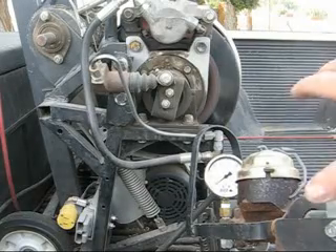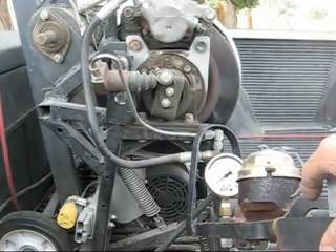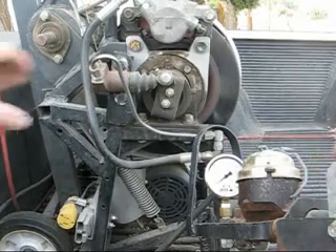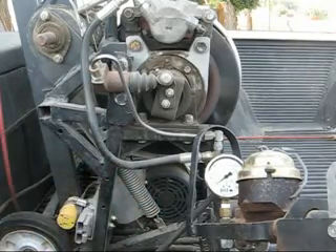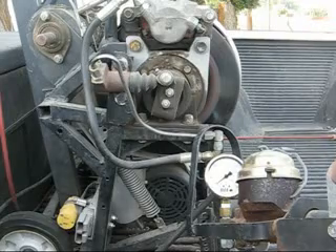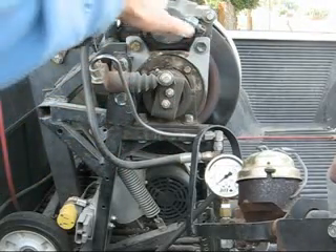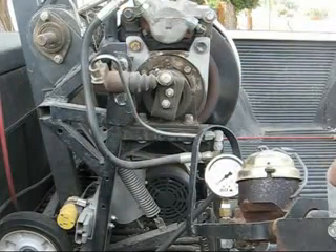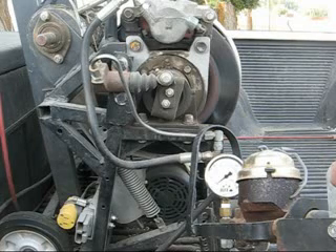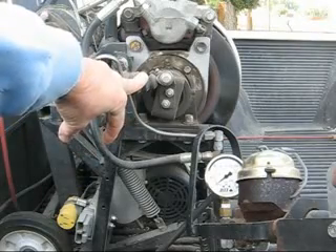In addition to the conventional hydraulic cylinder, master cylinder, and brake caliper used in the braking system on my auto-tension winch, there is a slave cylinder teed into the hydraulic assembly, and a spring used to control actual line tension. There's also a pivot mechanism connected via an actuator arm through to the hydraulics, which allows the brake caliper to free-float without resistance on the axis of the drum. You set your tow line tension with the spring, and the caliper will tension up and pull to the point where the hydraulic pressure is reduced to the preset line tension you're trying to achieve.